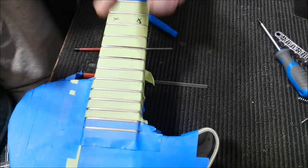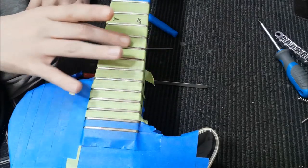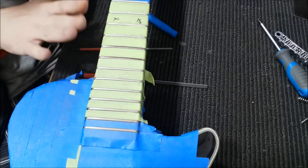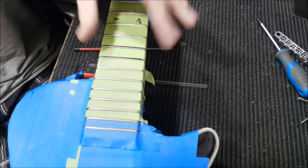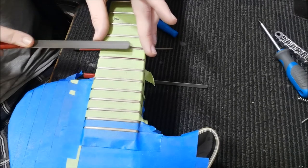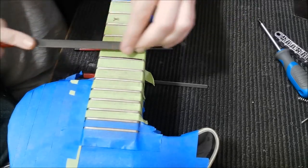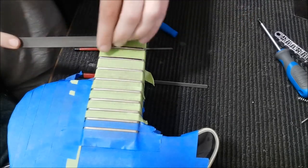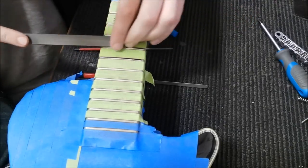Always watch what you're doing — really make sure you watch the edge at the end of the fret. Generally I find that because there's more pressure applied as you go down, this side is not as much of a focus as this side. Remember, this is the side you'll be seeing when you look down the neck. This side will always come out right because of the end pressure. Over here we just want to start filing in, gradually taking your time, going as slow as you need to. Just start rounding it over. I'm almost at the point where I'm going to switch files.